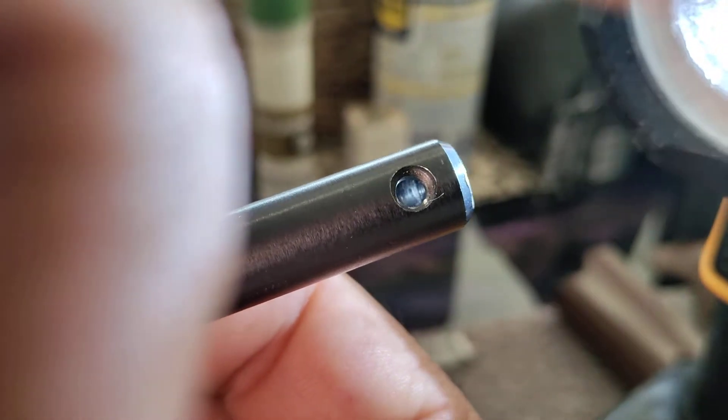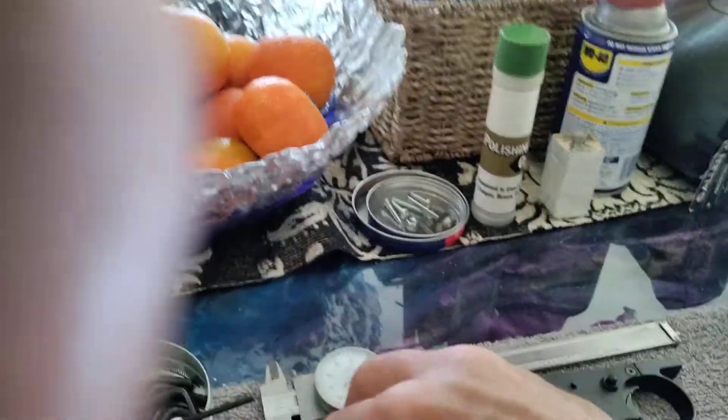After looking at flow numbers through cylinder heads and learning different velocity techniques, once you radius everything you eliminate turbulent air — in cylinder heads you keep air and fuel from separating, and here we're going to keep turbulent air from misdirecting our airflow from the back of the pellet. We're basically going to go around everything, create a funnel effect, and shoot right behind that pellet. I'm hoping for another 220 feet per second out of the same length barrel. We'll see what happens — thanks for watching.